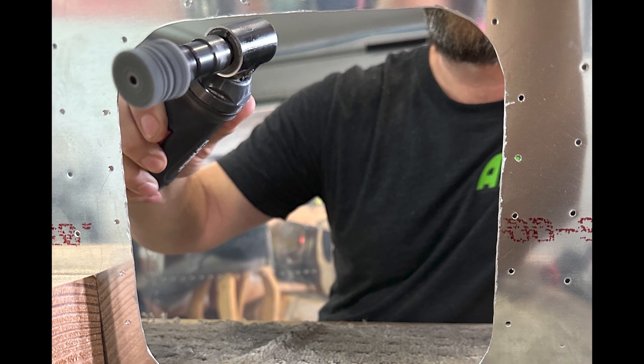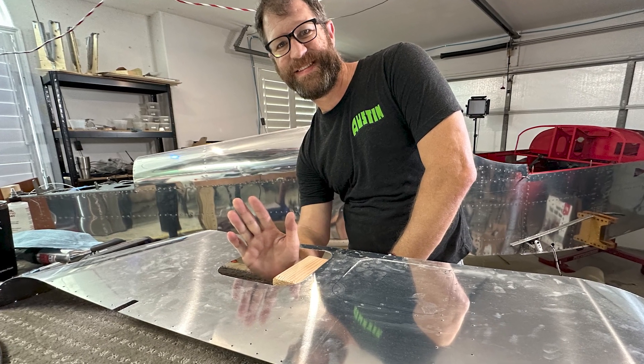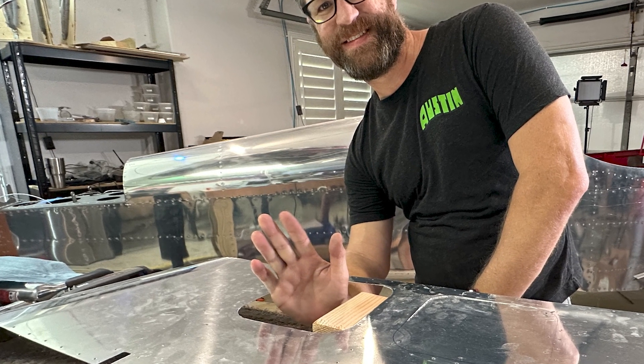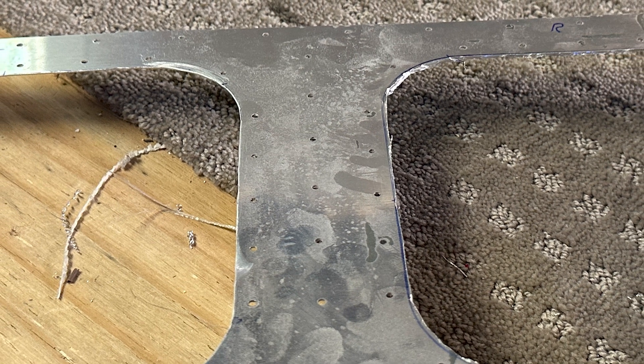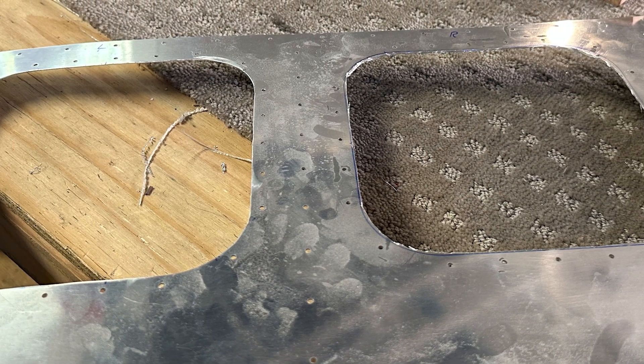The first one took us four or five tries. The second one we got down to like two tries. After you do that, you rivet the rings on — which we haven't done yet. We deliberately stopped at this stage because next you rivet the rings on, put some sealant down to form a weatherproof barrier — the gasket — then put some plastic down and squeeze it to make that gasket strong. I'm still debating whether to use fuel tank sealant or RTV; RTV's job is to be a gasket, so it might be the better option.